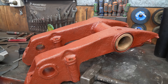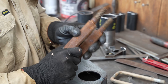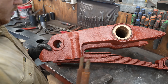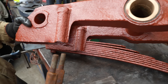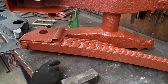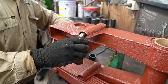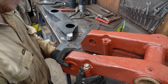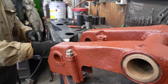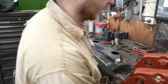We've got an original U-bolt — we're not sure if it's off a Panzer II or something else. This isn't the correct U-bolt, but it looks very similar. So that goes in between the housing, goes in here, and goes up all the way to the top there and bolts on. That holds the actual leaf springs in from underneath. We've actually got some U-bolts that we've found. These go in like that, out the top, and bolt on. So they go in there like that and they clamp the spring in. The spring is actually held in on the end via the bolt — that's what holds it in. So that's just a clamp — it clamps these up.